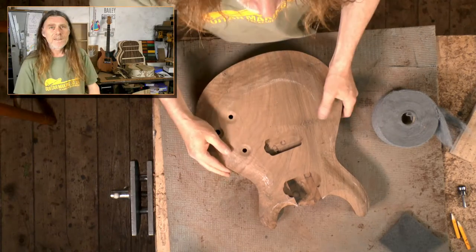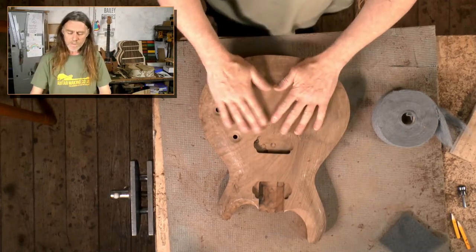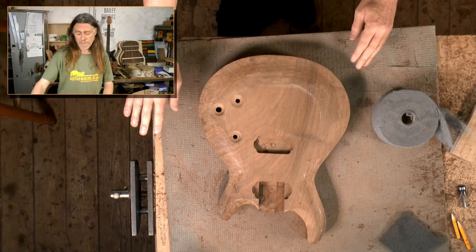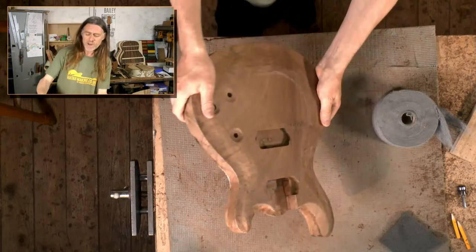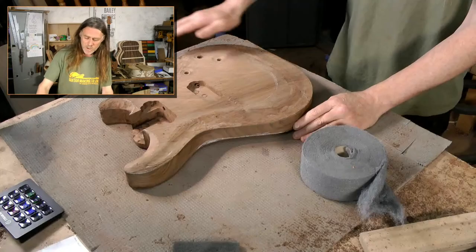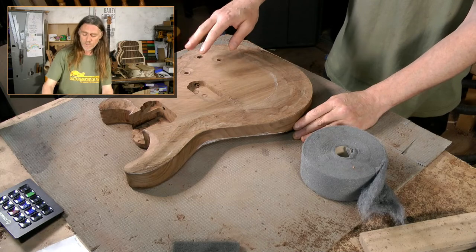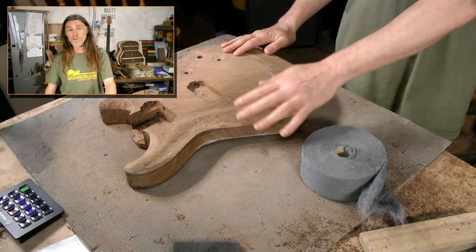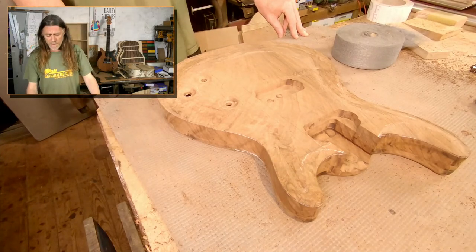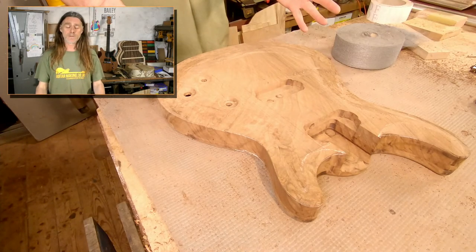The reason is that if you're ever going to spray this guitar, then you need to do what we call flat sanding. You're trying to get it mirror flat, so that you can see your reflection in it. If you've left any little lumps and bumps, when you're cutting back that lacquer, you'll end up going through it on the high spots. You'll end up with a bare patch of wood. Now, if you've got colour involved, that can be a complete nightmare. So the reason to get the flat bits super flat is to avoid rub-throughs.